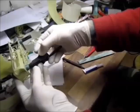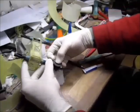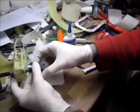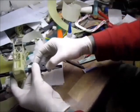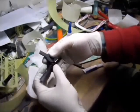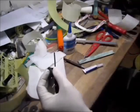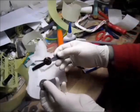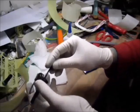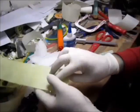As the motor's gonna be inverted, in the event of a crash, there's gonna be the tumbling, so it's gonna hit the motor first. So instead of doing the claws, like I would need more than two or three, I will do the motor protection, like a tube wrapping around. I don't have any carbon tube or glass fiber tube, 26 millimeters, because my motor is 24 millimeters in diameter. So I'm gonna laminate my own.